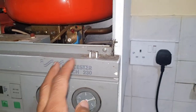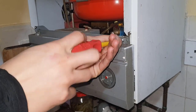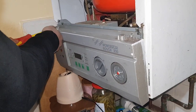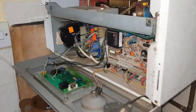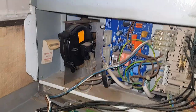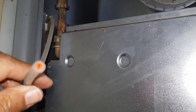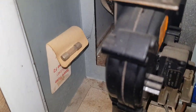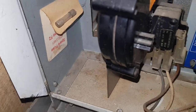So we're going to remove this screw there and there and lower that down. So that's the air pressure switch here. What we can do is suck on that and see if we can hear it clicking. We've taken this tube off the fan and blown down the tube which goes to the switch to listen if we can hear it click. So listen up guys.